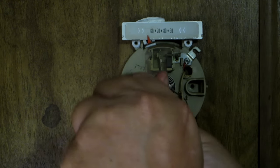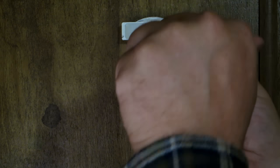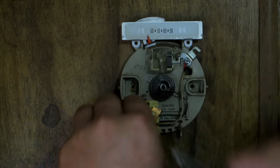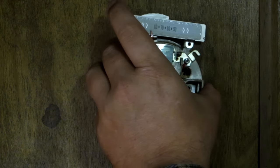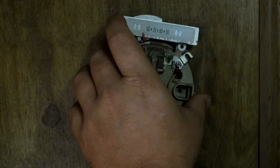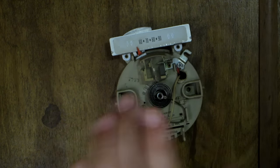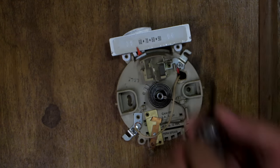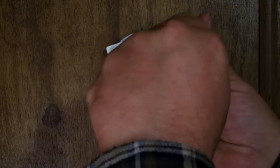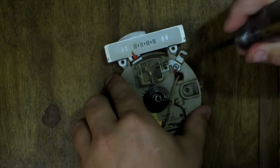What I'm going to do is take it loose from the wall — all you have to do is loosen these up a little bit and it should come right out. Just pop the wire out. One thing you have to make certain of: sometimes when they put these in, they don't give you an excess amount of wire and you could lose your wire back down in the hole, so you want to be pretty careful of that. Sometimes you can take some channel locks and get them back behind there to make sure it doesn't come off on you.